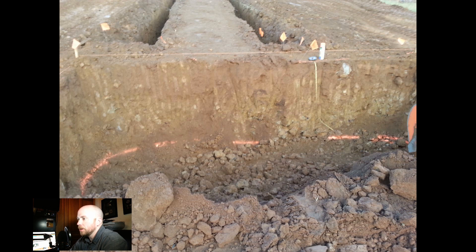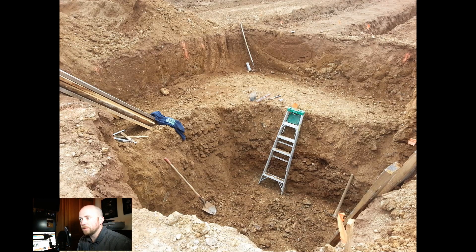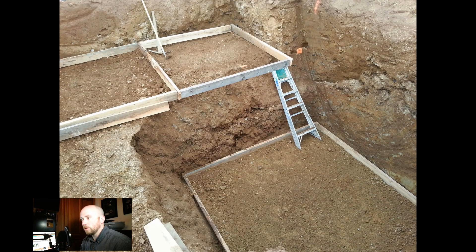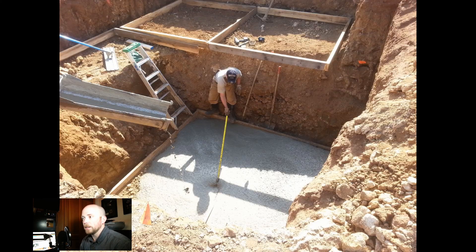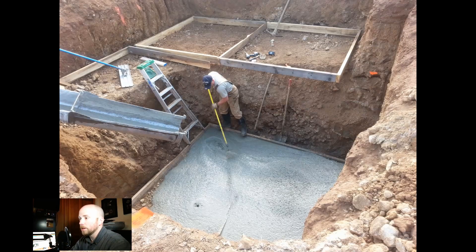Here we are at excavation, done in a tiered section with two levels. The first level is about six feet down and the very bottom of the hole is about twelve feet down. We're building the frames for the foundation to place the digester stomach and some storage tanks. The ground gave way in two areas on the frames, but we can backfill it. Cement was delivered — it saves a lot of time, and there's going to be lots of cement in this project.